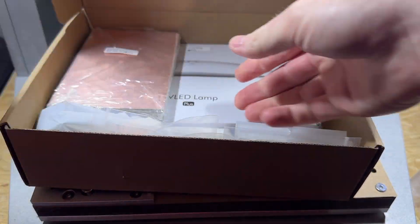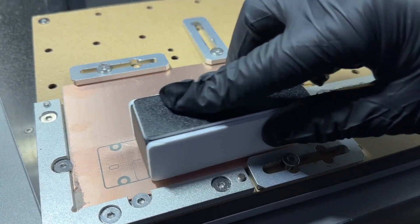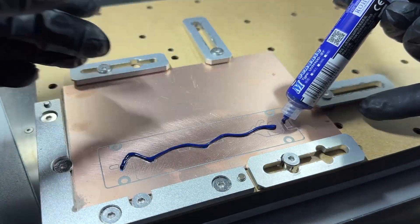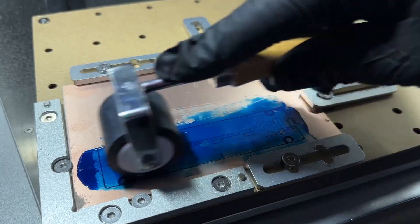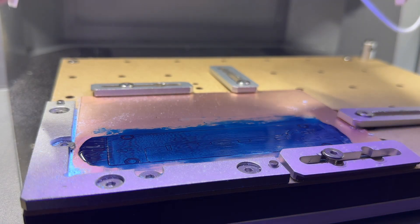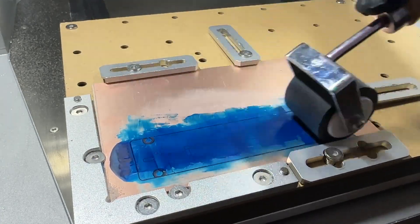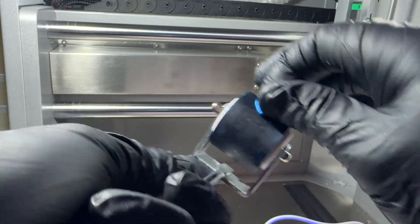Using the PCB fabrication pack, apply a UV solder mask with the resources included in this kit. First, lightly sand the surface of the PCB to scuff it so the mask adheres better. Apply the mask in a thin coat — it's better to apply multiple thin coats evenly using a roller rather than a single thick coat. Wear gloves as you should not handle uncured mask with bare hands. Between coats, use the UV curing lamp, which can be powered via the USB charging port on the back of the Carvera Air, to cure each mask layer. Typically two to three layers should provide an effective solder mask. Excess UV mask on the roller or clamps can always be cleaned up with alcohol wipes.